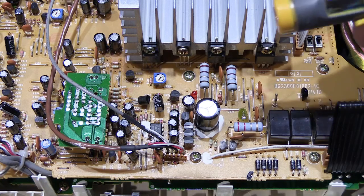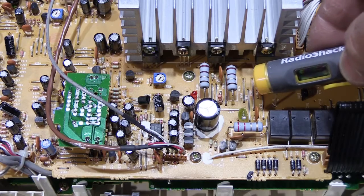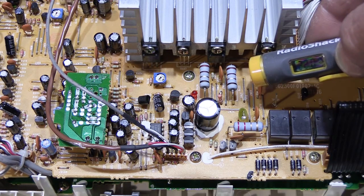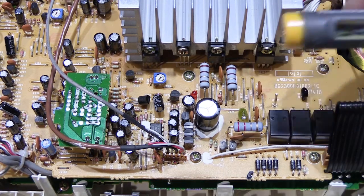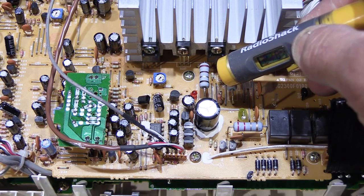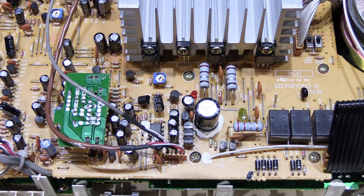Here's my little inexpensive Radio Shack infrared temperature probe. I'm going to point it at one of the resistors from about a half inch away — that one reads 22 degrees Celsius. The second one is 21.8 to 22 degrees, depending on how close you get. We're not doing critical temperature measurements, just getting a ballpark idea. They're turned off, at ambient room temperature. Now I'm going to power the set up and measure the temperature while it's on, to see how rapidly they increase.